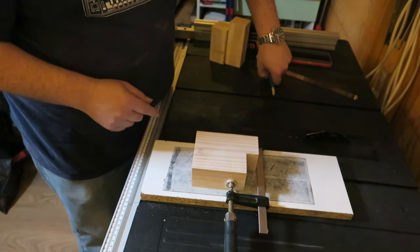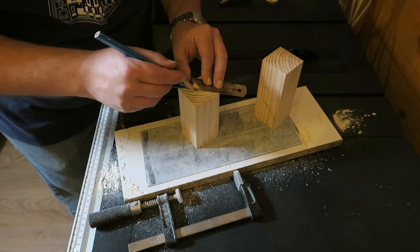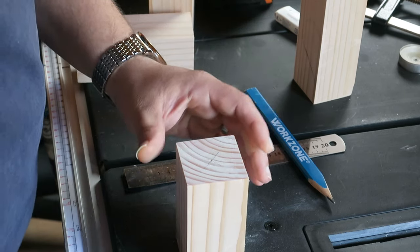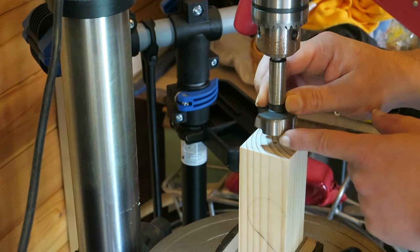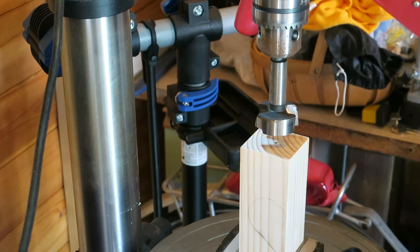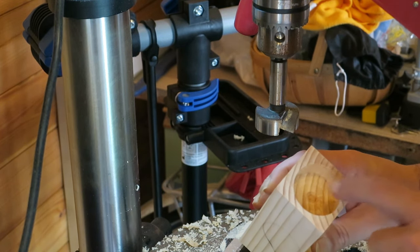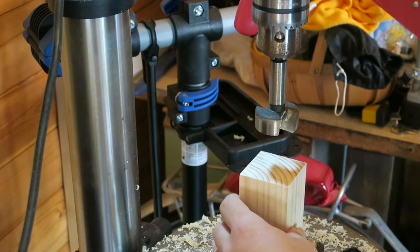I will draw the heart on. It's going to look quite cool. Drill press. I'm going to sink it to the depth of this Forstner bit — a little bit deeper than the tea light so you can fit all the tea lights. Oh, it went slightly off on one, pretty good on the others, but that's fine. Saw a bit in the eye! All right, next up the smaller one.